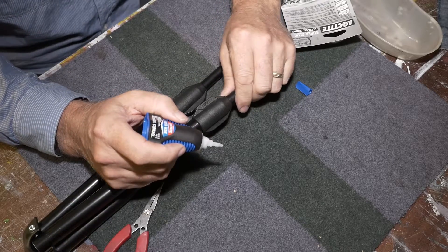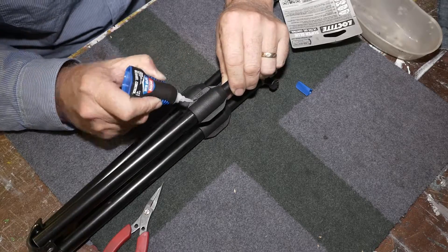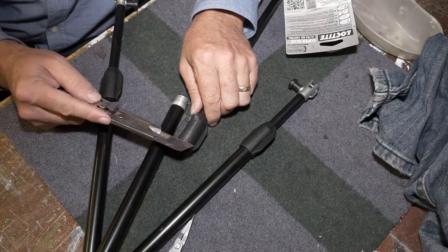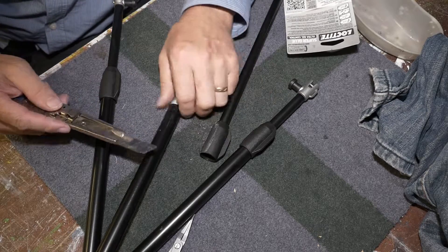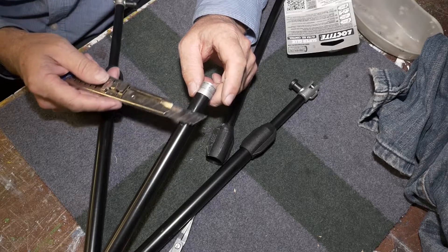What I did was I tightened the joint so it opened it up to let me get the glue in. A tip: to get rid of the excess glue that's spilt out, you can use a sharp blade very, very gently so you don't scratch the original surface. I can even get it off metal as long as I'm very gentle.